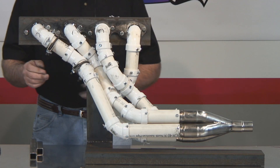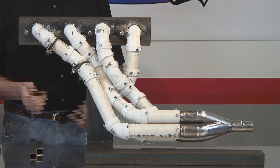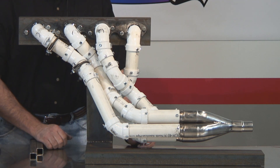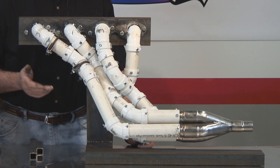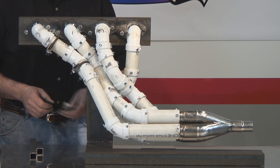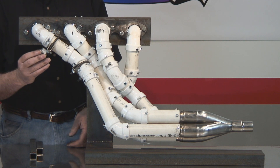Something else to keep in mind: if you're building a header that uses a larger tube — say it's mocked up in PVC inch-and-a-half schedule 40, where the OD is 1.9 inches — and you're going to build the header in, say, two-and-a-half inch, you might use a spacer like this to go underneath the clamps to account for the size difference.